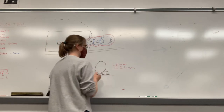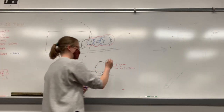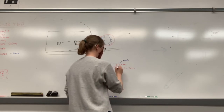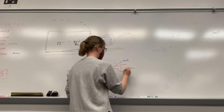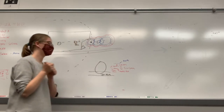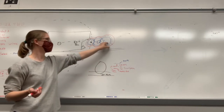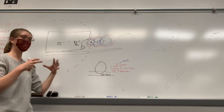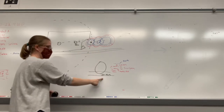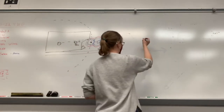The wall offset thickness is the distance from the bottom of the tooth to the outside wall. From the edge of the tooth to the outside of the gearbox might be eight millimeters. You'll put that offset distance in there, and now you have these four circles with that offset. You'll drag it until that red circle is a quarter of an inch from the bottom, and start playing around moving things until you get a layout you like.